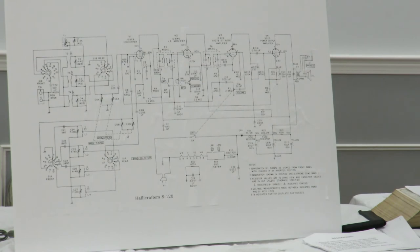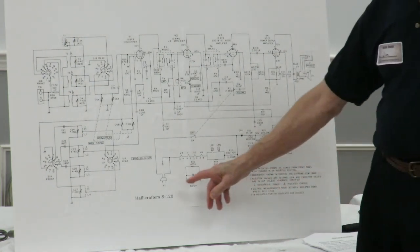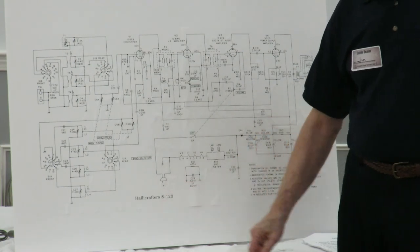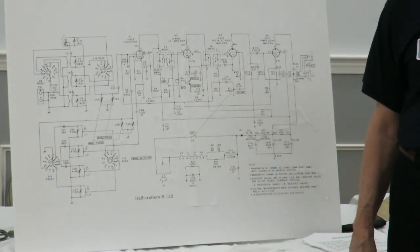What about a dim bulb? A what? A dim bulb. If you were using a dim bulb instead of the variac, where would that go? Wiring in line with the gear, in series with the line. In series, so. That's my preferred method, by the way, the dim bulb.